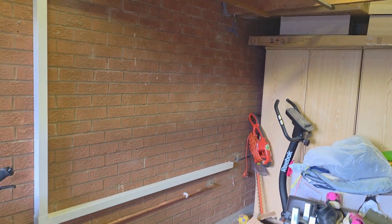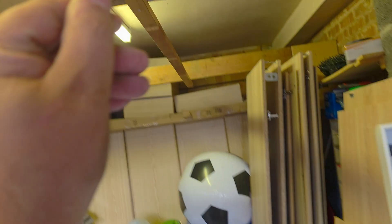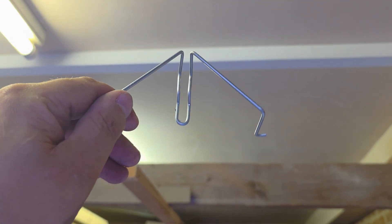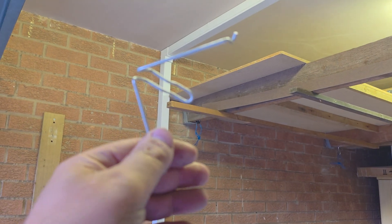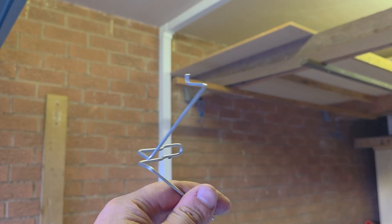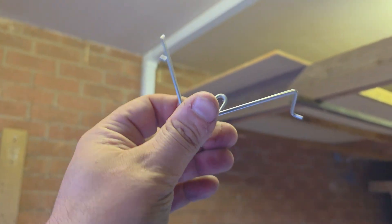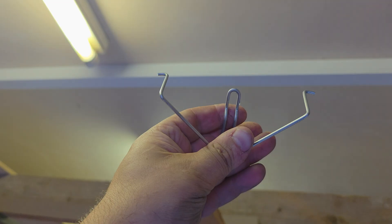Just to show you the trunking route: we've got some nice trunking across here — I still need to pop the caps in — and that runs around back under the stairs where we've got a switch fuse ready to go. We've got these fire clips here. Basically they slot in and the wings pull apart so you can run your cables through. You can fit these with the actual containment and then use them to pass the cables through — they'll hold them in place. It's not like having to screw a fire clip in and then twist it around the cables. These install into the trunking, sit there in place, and you can just drop your cables in, which is handy for fire-proofing but also really useful for supporting your cables whilst they're installed. When they are all good to go they clip around so they won't allow any of these cables to drop.